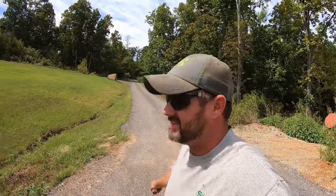I am tickled to death with it — it's absolutely awesome. Now if you want to protect them and get longer life out of them, there are some sealers on the market that are viable options, especially for a smaller area. I've got 700-plus feet of driveway and a large parking area. My plan is to chip and seal it next spring. Chip and seal is where they spray down a thin sticky layer of tack — a combination of asphalt and tar — then sprinkle rock into it, which seals it off and gives it a thin top layer. I'm probably going to use pea gravel because it's rounded and tires won't grab and pull it out as much.